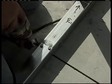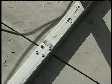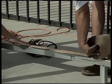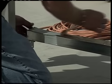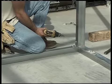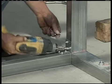Get these all connected using 4 frame screws for each joint. Use the sealant like you did on the eave side base rails before placing it on the concrete. Then place the 2-inch by 3-inch base rails to create the base of the end enclosure, and use a BK-20 or flat angle bracket on each end to affix this to the end upright.